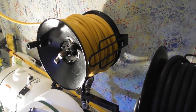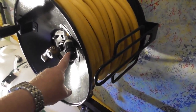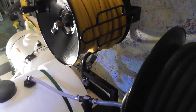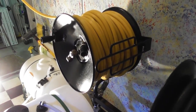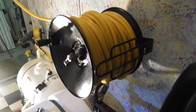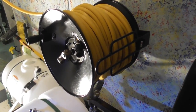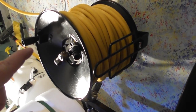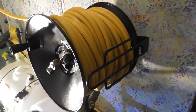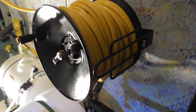This reel over here is made by the same company. That's a chemical hose and you can see the end here — I do not have it hooked up. I'll talk about chemical injections and downstream injectors in another video, but the reason is I don't want chemicals going through my reels and eating away at the seals and that inside tube. So basically that hose just has a crank-up handle on one side. I haven't connected anything — it's just basically a crank. I could use a cheaper crank, but I had that handy so I'm just using it.